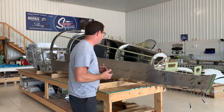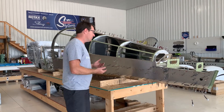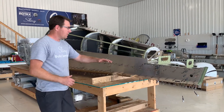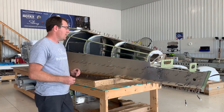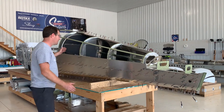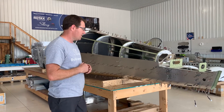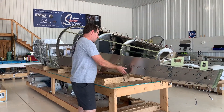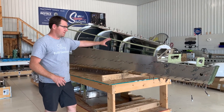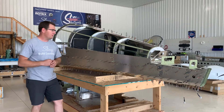Once those two items are done, you're left with your floor assembly — basically your floor skin with all the stringers. We're going to rivet that, omitting the side rails because we need to wrap the skins around those later. We'll rivet the bottom skin onto the stringers, then mount our bulkheads onto it with our stringers. Then we'll place our side skins on — we're going to only click those on so we can adjust them with the top skins as we go along.